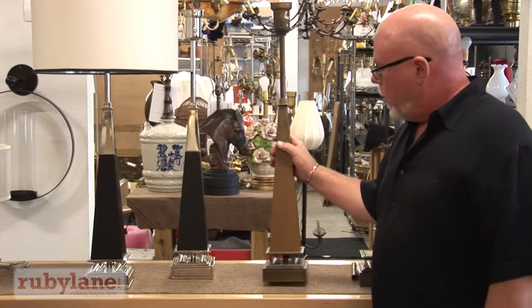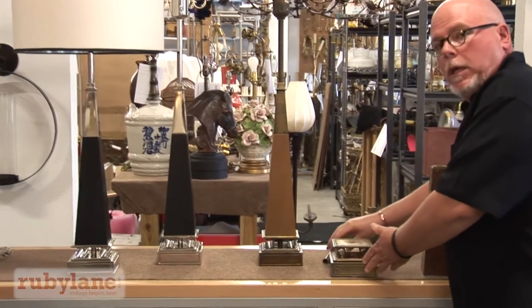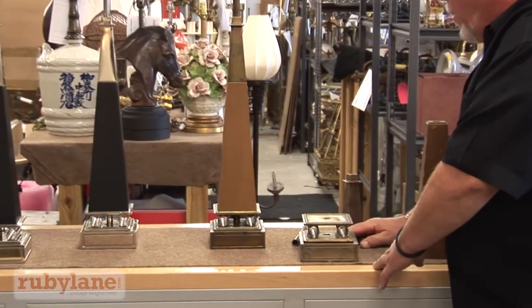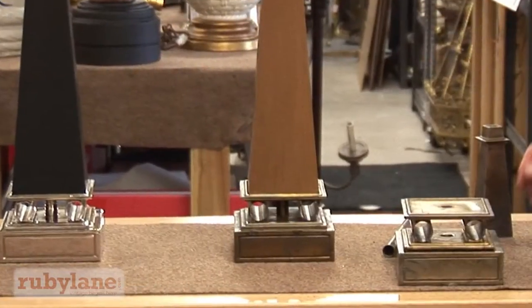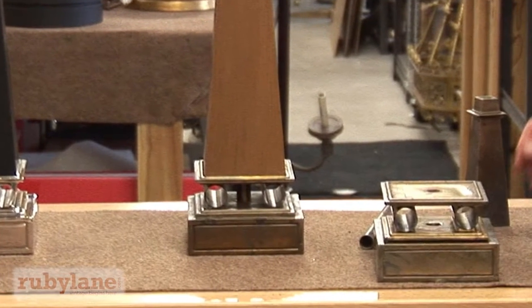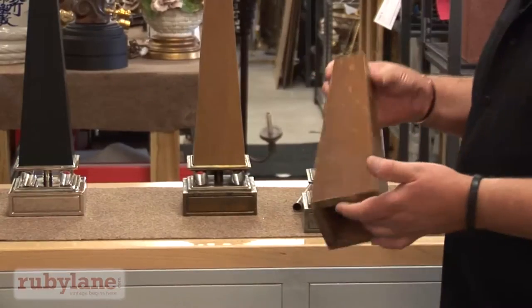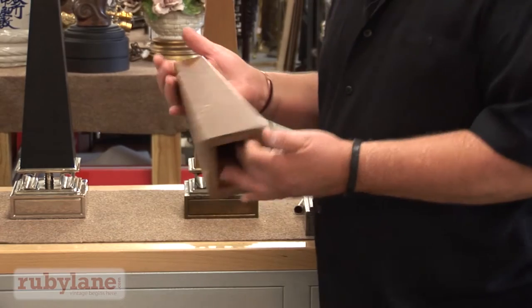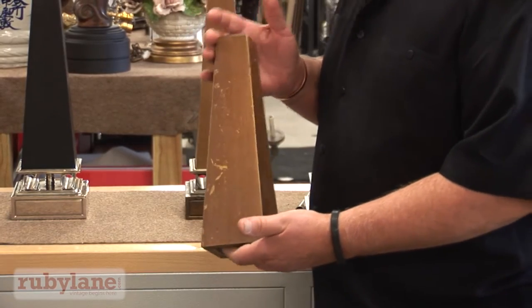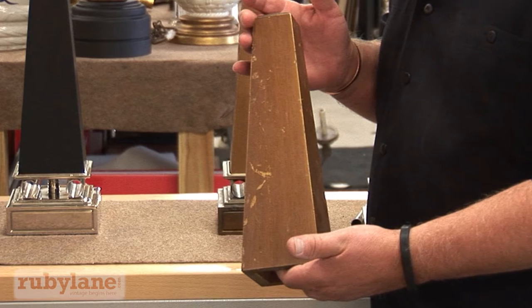What we will be doing is deconstructing it so that it can be plated — nickel plated or bronze plated. The metal being brass, there's a little bit of spelter mixed in this fixture. It can be nickel plated, chrome plated, or any sort of bronze patina. And Jeff will have his woodworker refinish the body. This could be white lacquer, it could be many things.